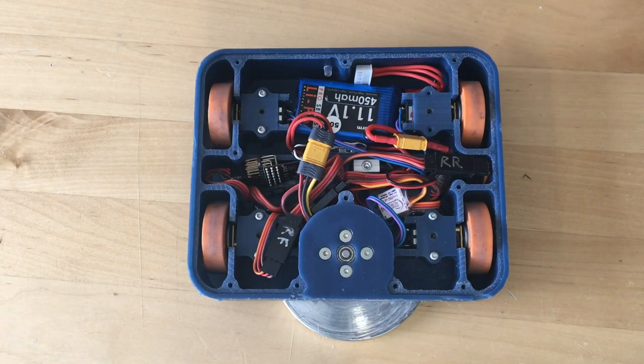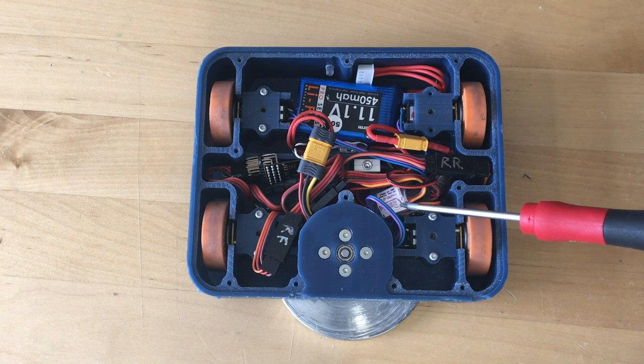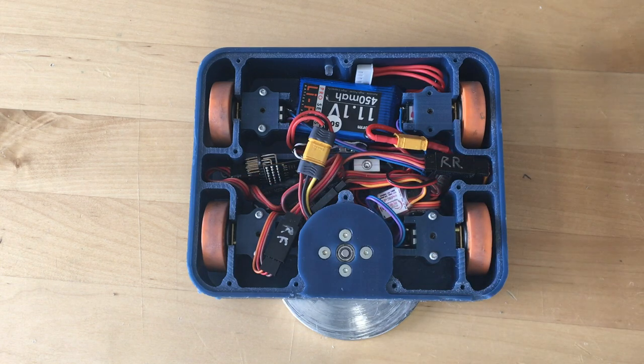Here's Blue Screen when it's ready to drive — everything in place. I'm using BaneBot wheels, ServoCity motors, Fingertech Tiny ESCs, a Fingertech power switch, and a LemonRC receiver. One thing I was trying to focus on was making it so the robot was still going at the end of the bout. Many times I'd see videos where a wheel or motor would get knocked out and the robot would just spin in circles. With this design, each wheel is powered by its own motor, so if one gets damaged, the other still provides motion on that side — some redundancy in the system.